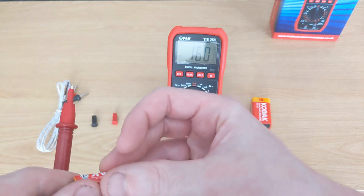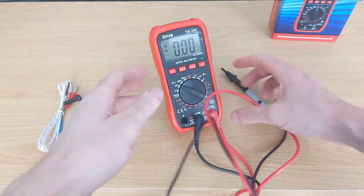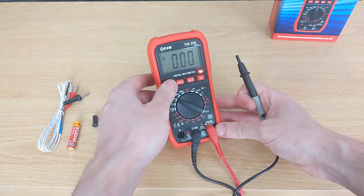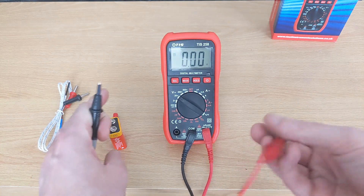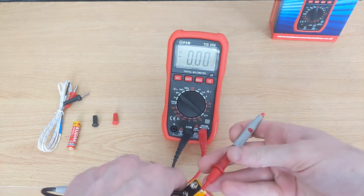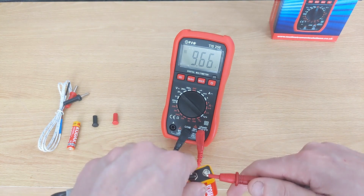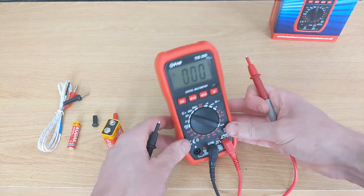Alternate current. At first I thought the meter was faulty. That top button also gives it a backlight — you can't quite see the screen on camera but you can in real life. So that's your AC and DC button. Let's change it to DC and try testing the 9V battery again. It does seem a little bit high — 9.7V on a Kodak battery. I'd have expected it to be closer to 8.99V. So maybe the multimeter needs calibrating, or maybe it's just because it's a cheap one and that's how it is.